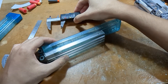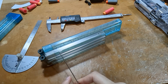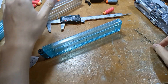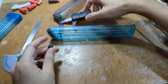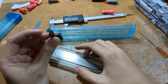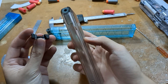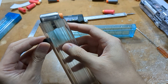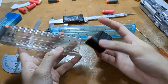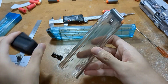With this measurement, you can then draw and model this notch — the dimension of this notch — and place it exactly where it is intended. Apparently the height of this notch is a little tall when I compare it with the magazine release, such that it can shuffle or wobble. The bump stop is actually the point whereby it prevents that wobble.